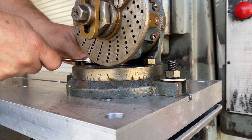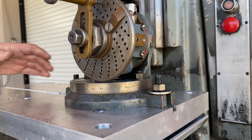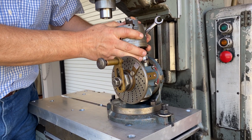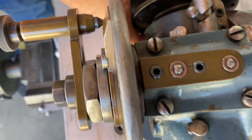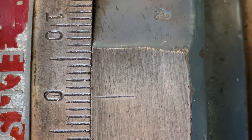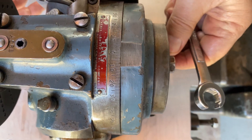That bolt is about 11/16ths or something like that. Setting the angle is relatively easy on the dial, but we need to bring the chuck down so that it's horizontal — it's got a dial also. When you look at this dial, you can read it to probably 15 seconds. Those are degree marks there, so we're just setting this up by hand — sorry for the wiggly camera, but we're pretty dialed in.